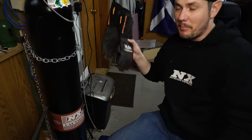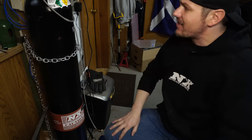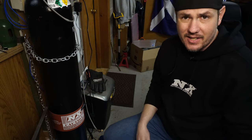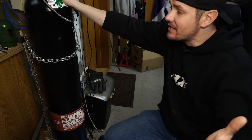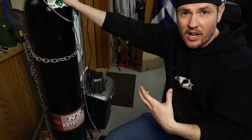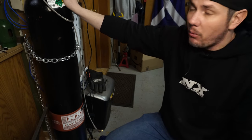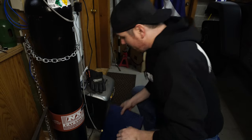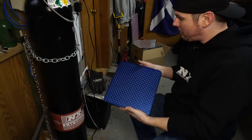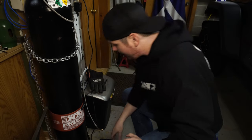We're going to need a pair of gloves — I've got an extra set of welding gloves. You've got to realize that this stuff boils at like negative 40 degrees centigrade, so it is very, very cold. It is in a liquid form and it gases off literally like boiling water, below freezing. You don't want to get this stuff on your skin. Wear gloves. Wear PPE. Be safe. And last but not least, we've got a scale — just a postage scale, but this one actually goes up to a couple hundred pounds, more than ample for what we're trying to do here.